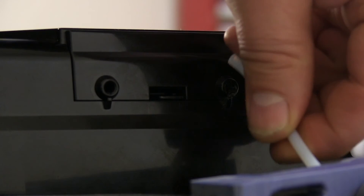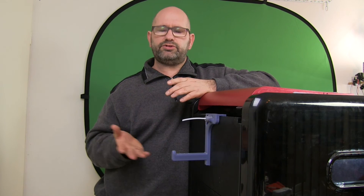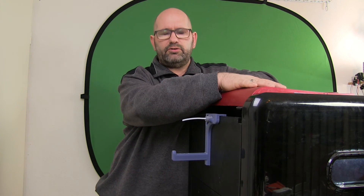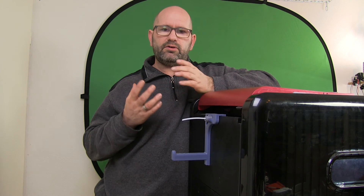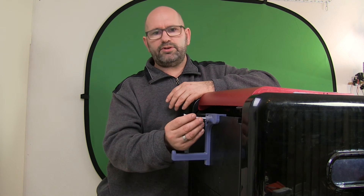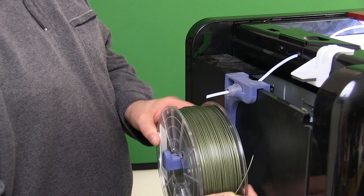Then you can run the PTFE tube to the inside, and the filament goes in here through the tube all the way to the extruder motor. From the extruder motor it goes directly into another PTFE tube to the carriage. If you do it this way, it's a very smooth path for the filament and there is not a lot of wear. It's very easy for the extruder motor to get the filament from the spool directly to the nozzle. This is what I really encourage you to do because it costs only a few cents and makes the printer so much better.